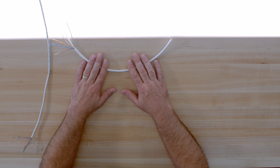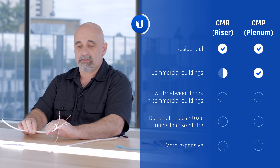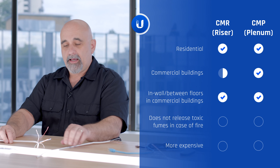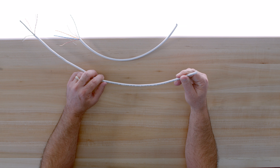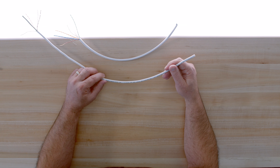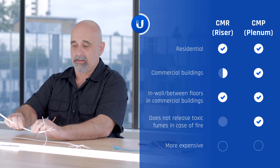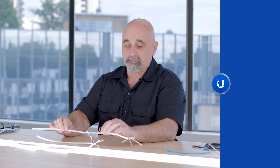There are also two different types of cable used in installations: CMR and CMP. CMR stands for riser — that's the cable you'll use in your house or some buildings, running through walls, ceilings, and attic spaces. The other type is CMP, or plenum. The plenum jacket has been specifically built and tested to not release toxic fumes in the event of a fire, unlike the PVC coating of a CMR cable. It's a little more expensive, but the standard practice is to always install plenum-rated cable — it's the safest way to go and you don't have to worry about local code requirements.